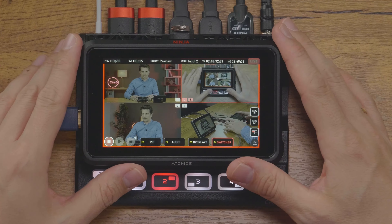Now let's take a look at the connections. There are four full HDMI inputs, each supporting up to 1080p or 1080i. There's also one HDMI program out with up to full HD resolution and a USB-C cast out with the same resolution. The cast has no separate on/off switch — it only turns on when attached to a Ninja V or V Plus. The cast also has to be set as the source on the recorder: in the menu, under source, you switch from HDMI to AtomX Cast.